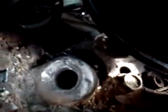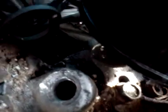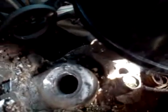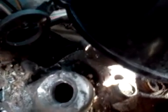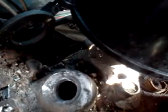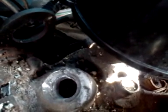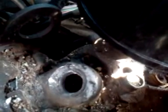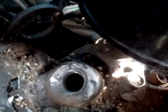Okay, so the easy out isn't doing a good job, except for one thing. It's doing a good job of reaming that fitting out. And I don't know if you can see, but there's a flake at the top. And we've gotten close enough to the threads that we can go in there with a punch and a hammer and very carefully clean that stuff out.